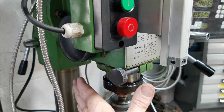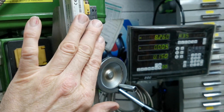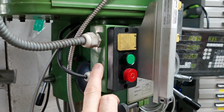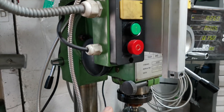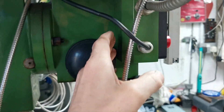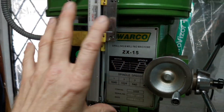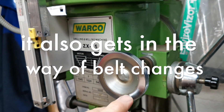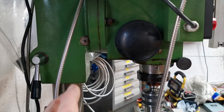The plan is to make a collar to go around here with some flat sides and hopefully some bolt holes to bolt a plate to, to connect up to the encoder on the side. I think I might relocate the power switch box from the side to somewhere else on the machine, because this is the only available area to mount it where it won't get in the way. It's sticking out a bit here, covers your speed feed, and on this side you've got your down feed, so there's just no room to mount it.